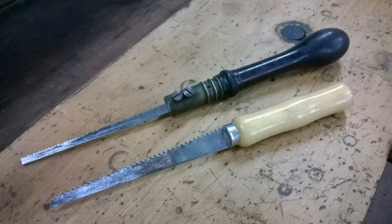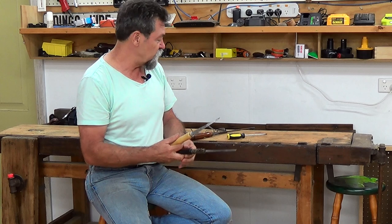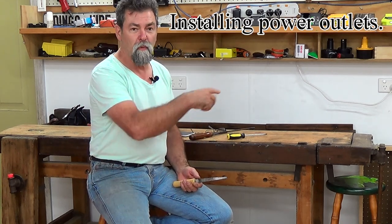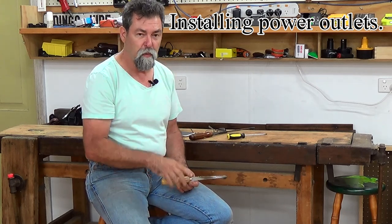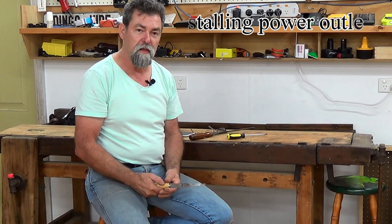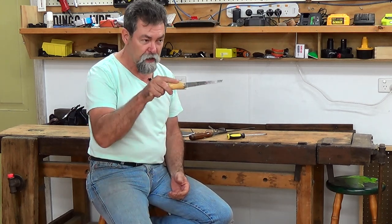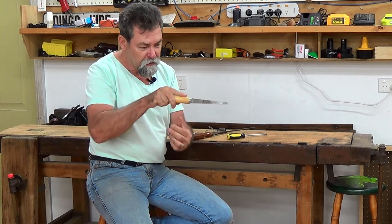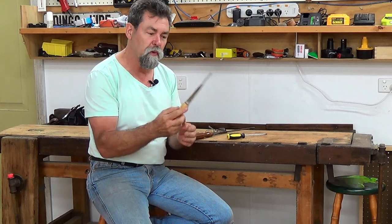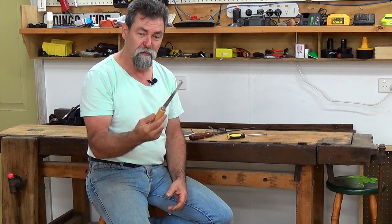Look at the difference — you'd much rather own this, wouldn't you? But I used this when I was building. We'd jump in and the electrician would run the wires in the wall, and we'd have these little metal plates on the stud work, and the wires would be just behind there. The plaster would come in, put all the gyprock up, then we'd go around with this and just punch a little hole in. No chance of cutting the cables behind, because we had a whole lot more control than if I was to use a jigsaw. This is a quick tool for these days.